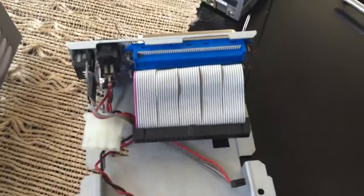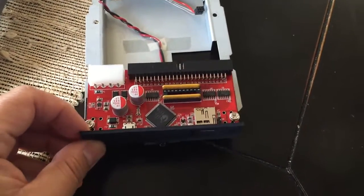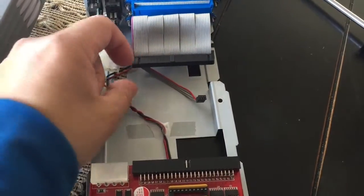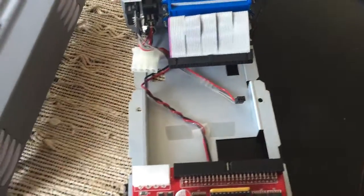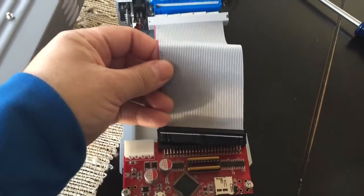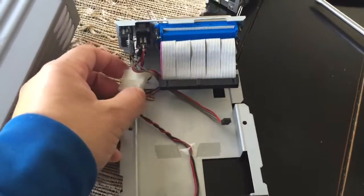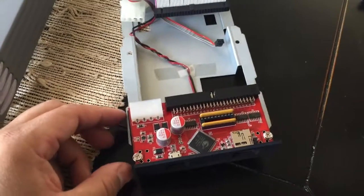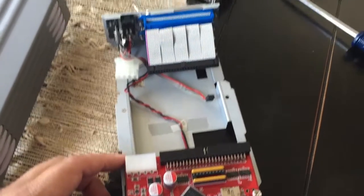The board is going to sit right up here and screw in. The power cable isn't going to reach, and neither is the SCSI cable — but for the SCSI cable I got an extension cable so it'll reach perfectly. For the power, I'm going to leave it unplugged because the samplers I use this with all support SCSI bus power, so I don't need to power it externally.